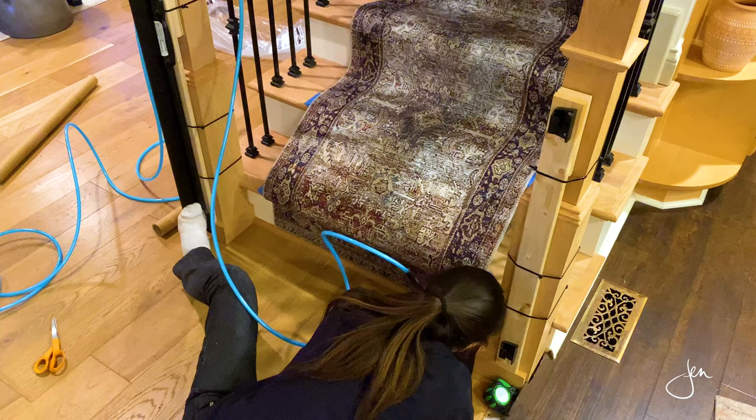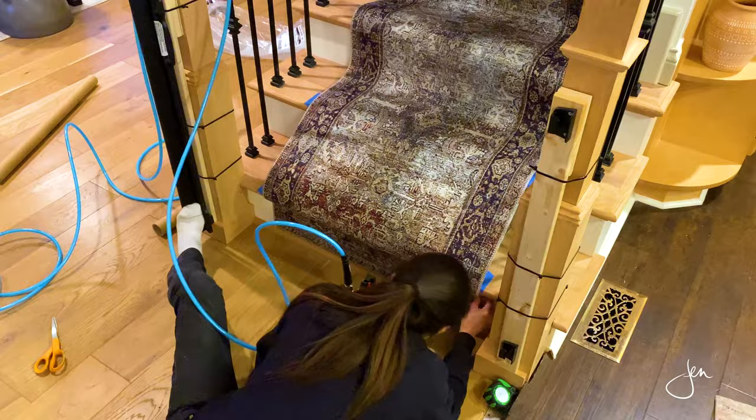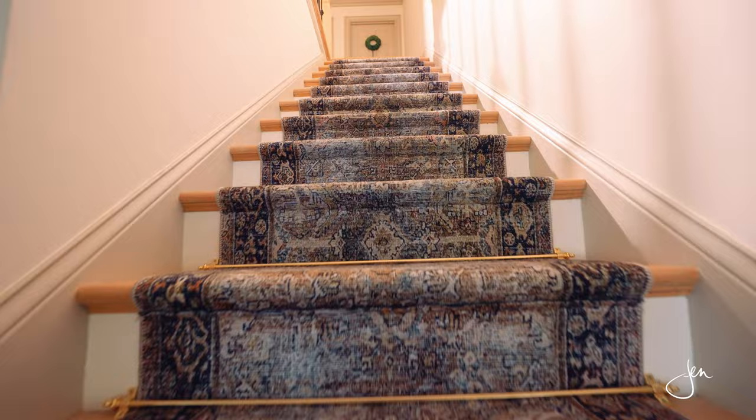Just be sure to double and triple check your measurements because you want the rugs to line up exactly with the previous one. For this last rug, I only put in 3 staples at each run, just in case I had to pull it back up because I somehow veered off course. Fortunately, everything lined up according to plan, and so I was able to go back and add the rest of the staples.